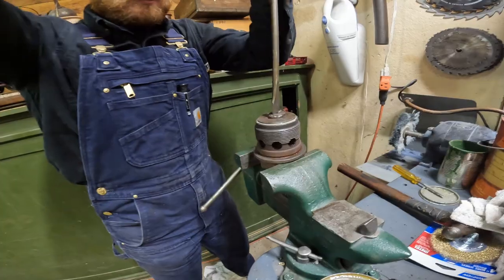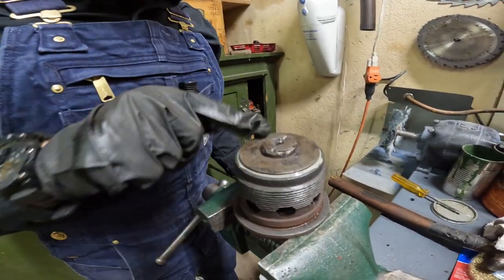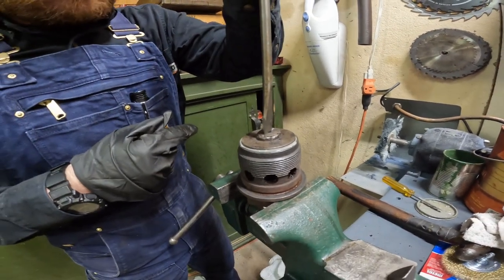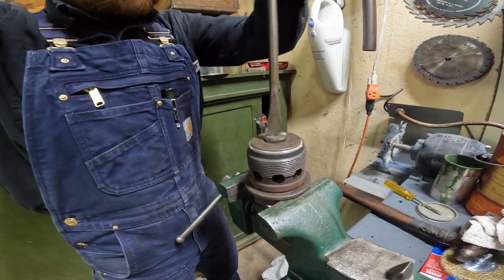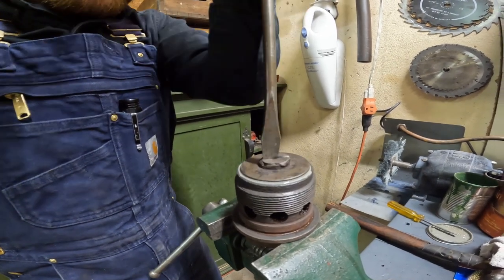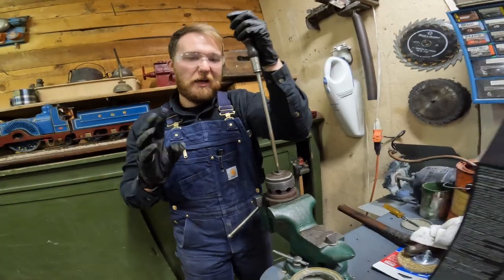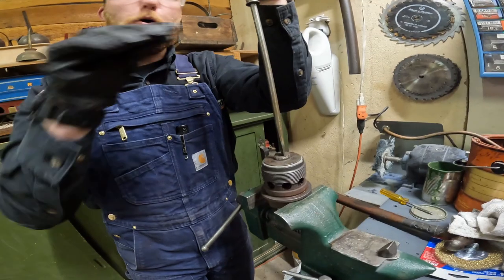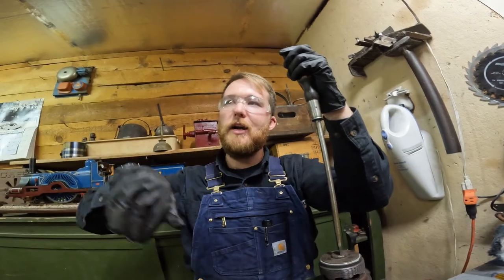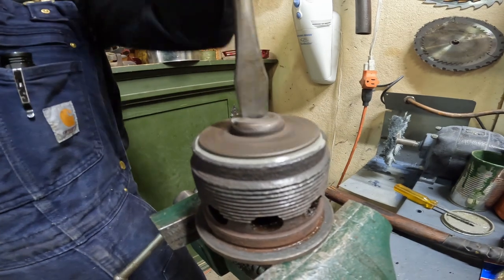To polish or even lap a valve like this, you can see there's a slot on the back side of the check valve. That's literally for a flathead screwdriver, so you can fit it in here, apply a little bit of pressure, and start going around. The reason I'm not going in full circles, and am going in a mostly random pattern, is it allows those grains of lapping compound to go back and forth, so they don't get stuck in one direction and ground down in one direction. It also cuts a little faster. You do this for a couple minutes.